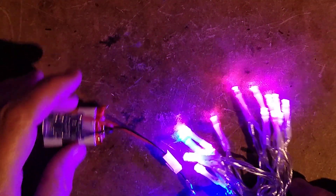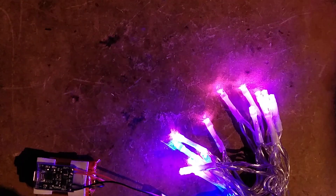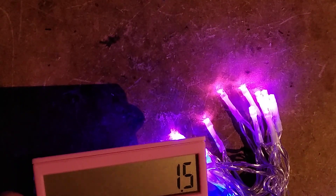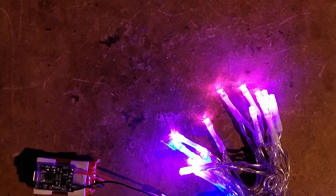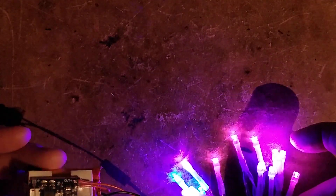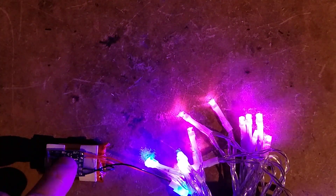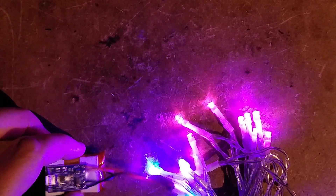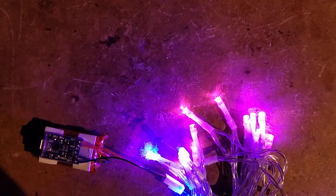That's quite a nice result. The LEDs will run for a very long time - the current is relatively low. The voltage drop is roughly 1.5V on a freshly charged battery, divided by 33 ohms, so it's only about 50 milliamps. That should run for about a full 24-hour day on a full charge, meaning if you charged it at the beginning of the evening it'll run into the next day easily. These batteries should last you for about a year of illumination just charging and discharging, because you typically get 500 to 1000 charge cycles out of these discarded lithium cells. Quite a good result - that is basically how to turn garbage disposable devices into fairy light power sources.